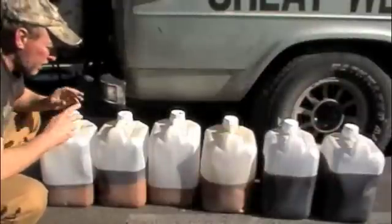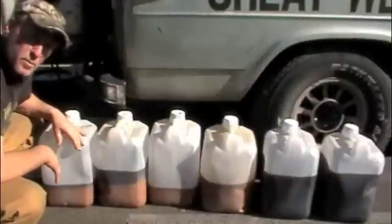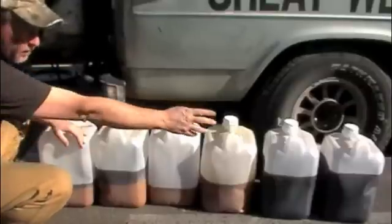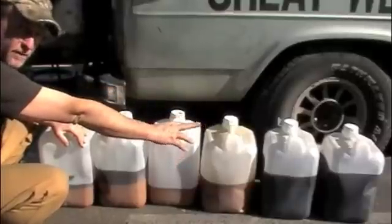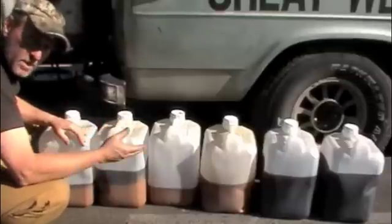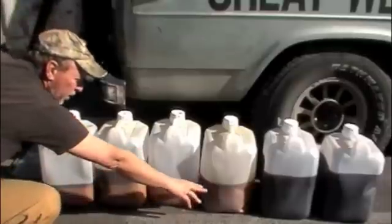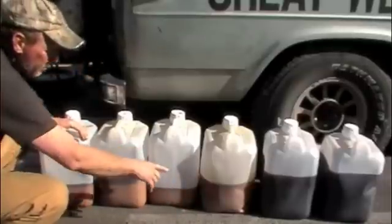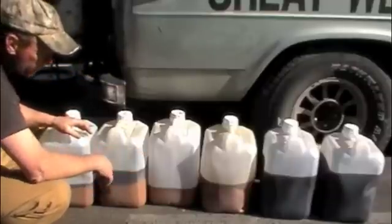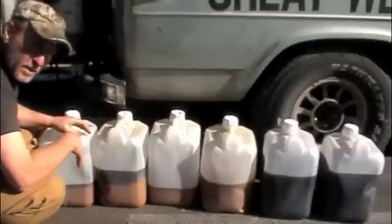When collecting waste oil, sometimes it comes in five-gallon containers, and sometimes it's easiest to process it in the five-gallon containers. As you can see on the far right, the containers are fairly dark, amber-colored. If we were to pour that oil out, you would be able to see through it. These other four containers have a kind of creamy white stuff at the bottom with some amber floating on the top. We're going to transfer the amber to the amber containers because that's what we can use for blending diesel fuel.